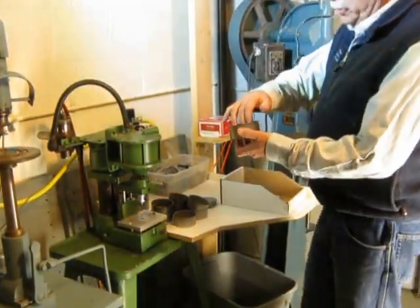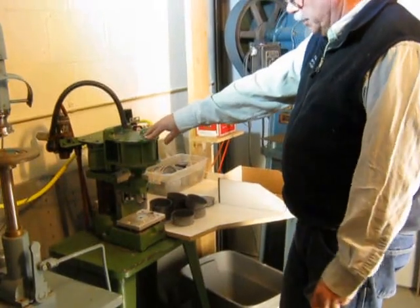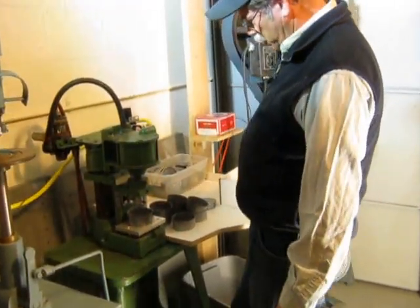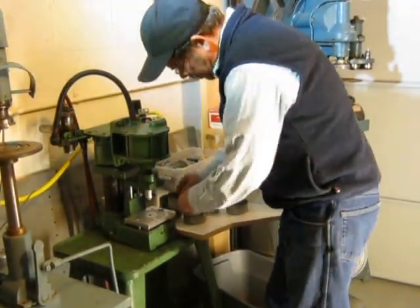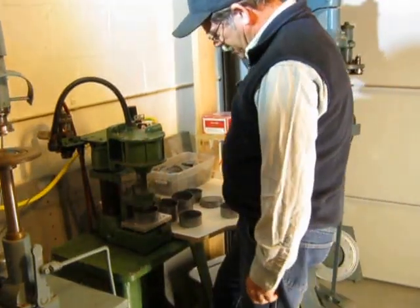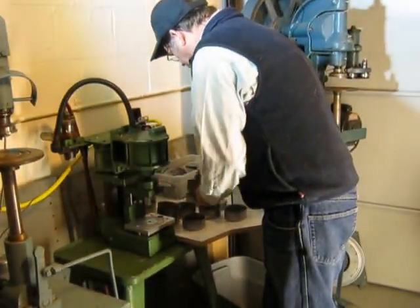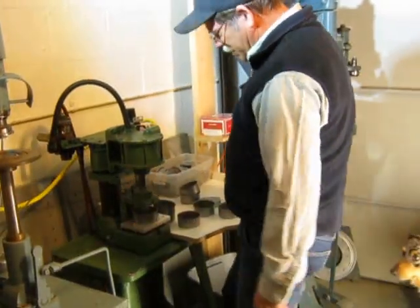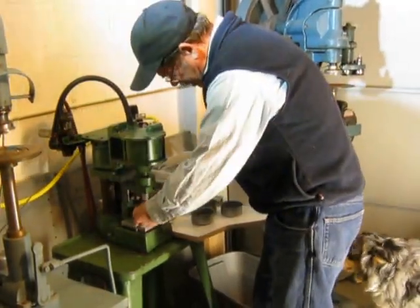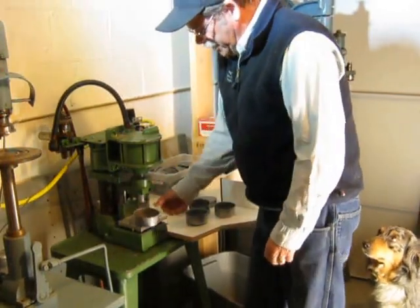All my kits, the boards sit on top and there's a hole through the center of the bottom to hold the two together with a little bolt. I have this air-operated punch press I got from a jewelry gold chain making business in Providence, Rhode Island — I went all the way down there to pick it up. I made the tooling for it and you just womp it in there. I used to do all this by hand with a Harbor Freight punch, but after thousands of cans I got really tired of using that hand punch, especially when I had to punch up a hundred cans for an order. So now I just have an automatic little machine. There are eight holes in the bottom of the cans, perfectly centered.